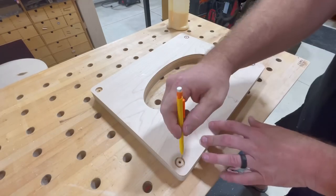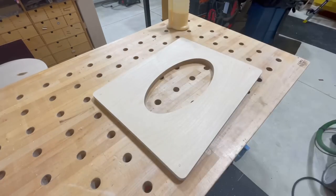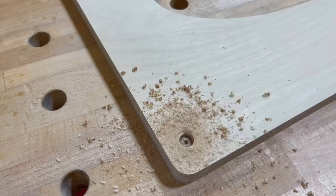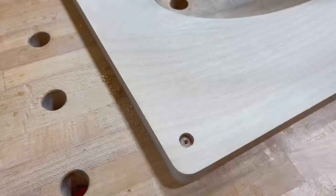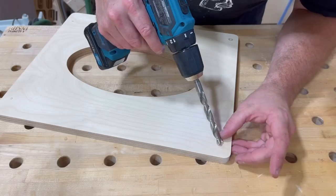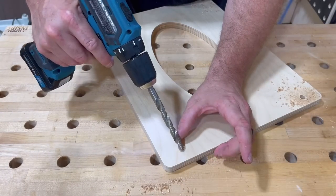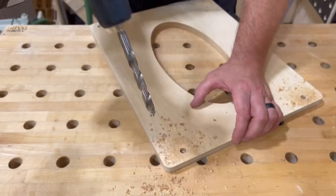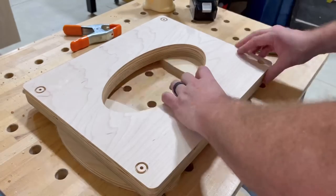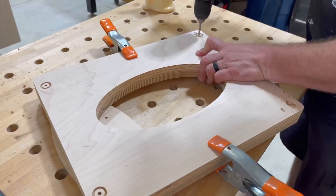So I need to transfer the holes through this piece of material. You're thinking, why don't you just drill through it? But I have to actually put a recess in there. So I'm going to mark it first, remove that piece, and then put that three-eighths-inch recess in there. And that's going to basically encapsulate or recess the pan-head screw — the proprietary Festool pan-head screw that comes with the vacuum. So now that I know the depth I need, I'm just going to eyeball this. I'm going to go around all four corners, making sure I got the right countersink done for that screw. Now I'm going to attach everything back. I'm going to use a few squeeze clamps and then take that same drill bit to transfer those holes all the way through the piece.